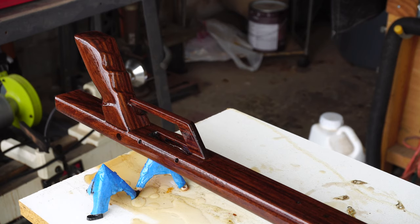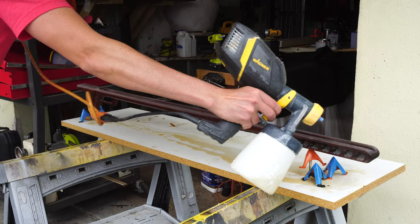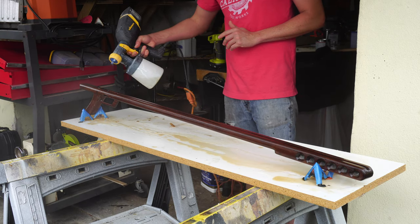Ultimately, I applied around eight thin coats over the spear gun without the mechanical components installed. What I'm going for here is what we call a wet finish. A wet finish is not really wet — every single time I spray a coat down, I'm waiting approximately one hour, and I set a timer to take the guesswork out of this. Every time that hour hits, I check to make sure the spear gun is dry to the touch, then spray down another coat. When you do the wet finish, you don't actually have to sand between coats — it's almost like a lacquer where each coat burns into the next. The spray finish with the thinner makes sure I have a nice smooth surface, and the idea is to keep building these coats to further protect the gun from wear and tear.